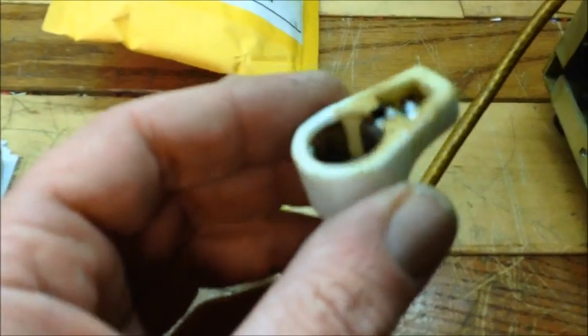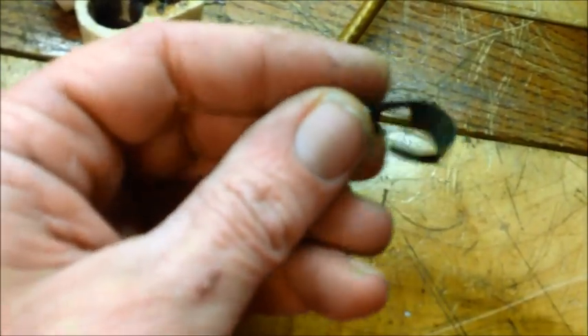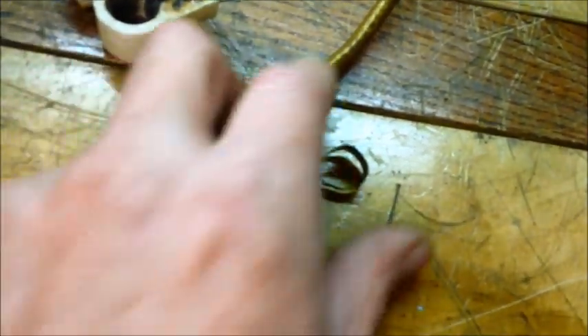One of the things was I've replaced all the caps at the top here — this is what it had in it. Because of course somebody modified it, these were just really, really in not great shape. I mean they're still salvageable — probably clean them up, they'd still be okay — but I went ahead and elected to get 4 of them. But when they modified it, they just put these rings around the tube. Not really great contact, and as you see what they look like, they're not in real good shape, and they don't completely go around the tube, so that's not good.